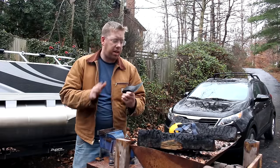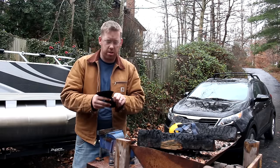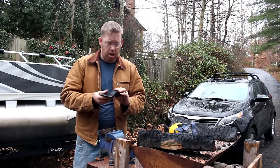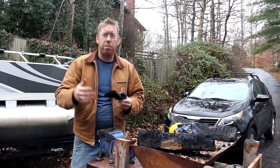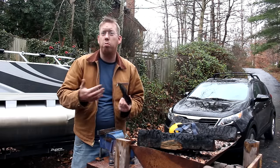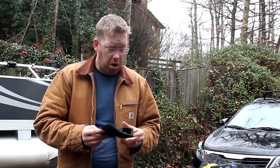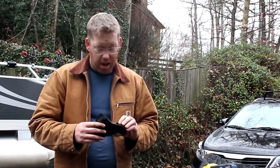Now that this axe is heat treated, I'm gonna knock off all the scale and carbon and smooth out the scratches. Get it all polished. A lot of you will be wondering why I'm not tempering it in an oven, and that's because tempering is a process used to help soften steel that is too brittle and too hard. Currently I have no reason to believe that that is the case with this steel, and if I'm wrong, it'll make an interesting video.